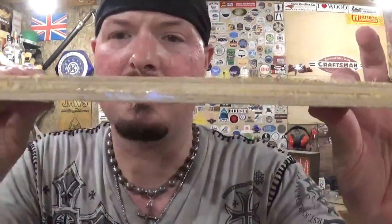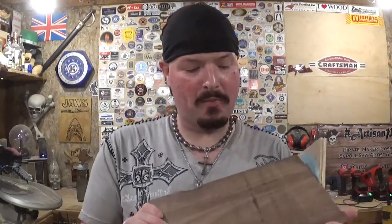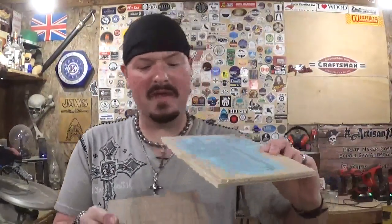We're going to stack cut and make two. I've got the pattern printed out to full size and attached with clear packing tape. That's all I'm going to use to hold the two layers together. And then we will head over to the workbench and make a backer board out of this piece of dark walnut. It's got some imperfections, it's got a split in it, but I think I can get enough out of it to make at least one of the backer boards and finish it in this video here.